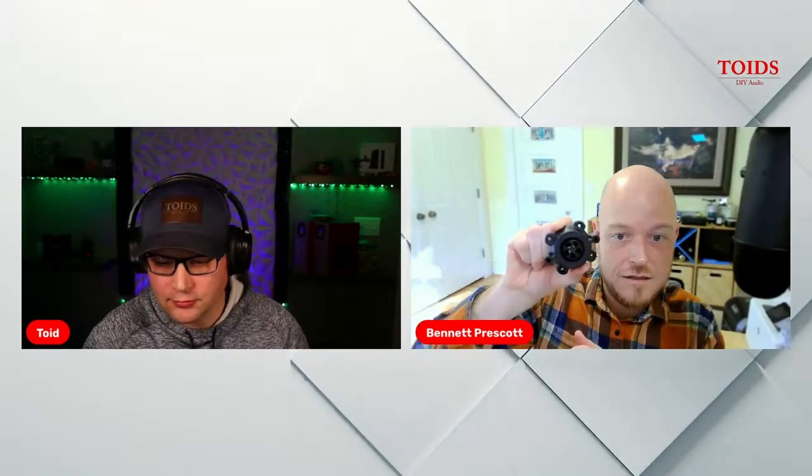The DH series trick is the center path — if you remove the little middle bit, it's twisted. It twists in 3D before the sound makes it out, and that is the innovation that lets us use normal tooling. It's very inexpensive, super easy to do at high volume, and gets the two paths in the phase plug to equal length. That's the trick that makes it work, and that's what we have patent pending on. Here's the phase plug from the bigger DH450 — still two paths, but the center path is twisted. That's the technology.